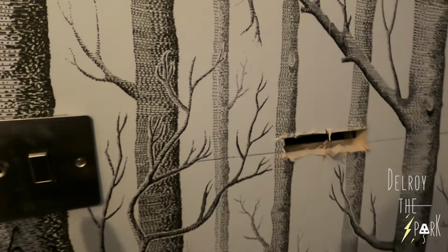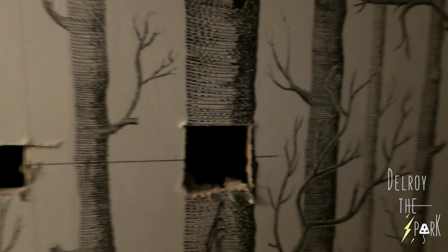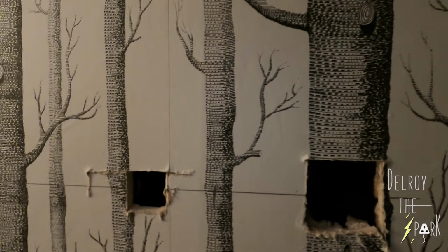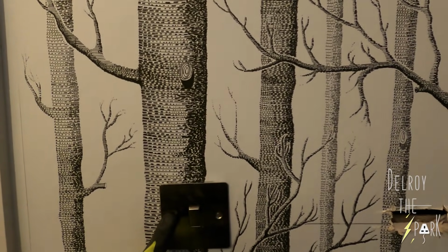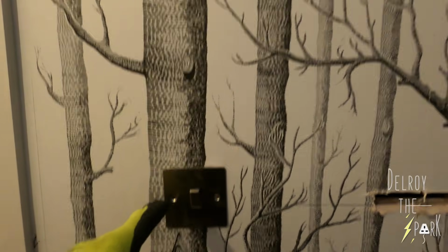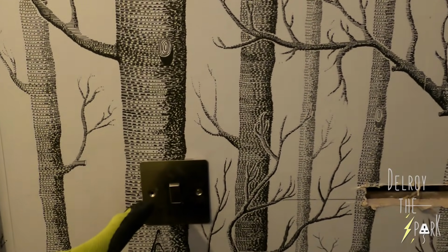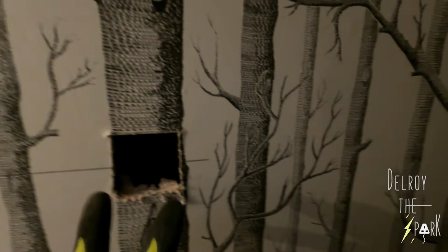Now, what you're going to have? You're going to have switch here. Two switches, what the lady wants. She wants two switches here, two switches there, two switches upstairs, so you can switch downstairs and upstairs lights as you like. So what I'm going to have to do is have a three core coming down from that switch to this switch, intermediate, then go along here to another two-way.